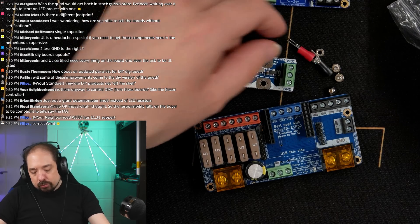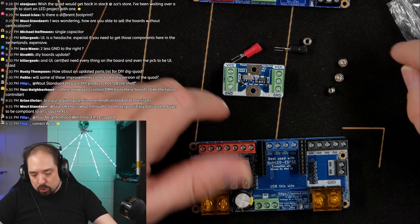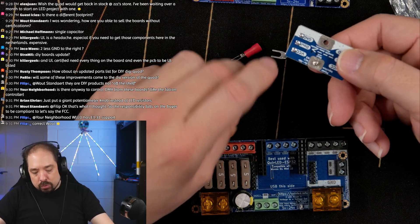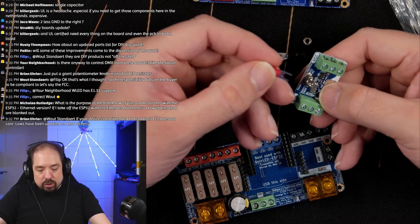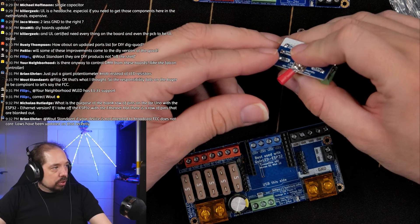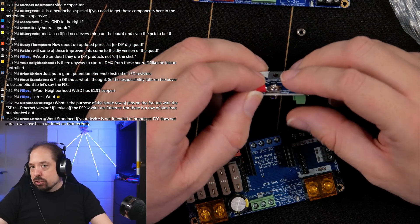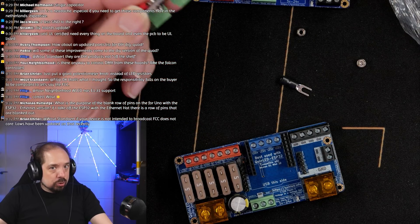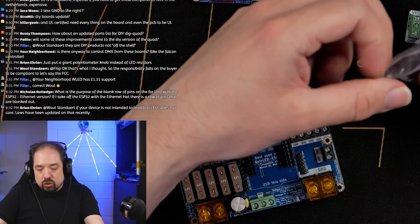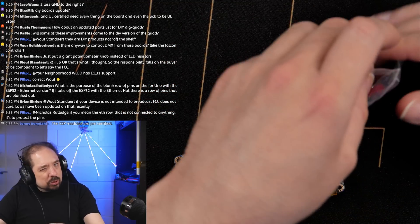The Data Booster comes with some accessories: two fork-style crimp connectors for use with the M3 size holes, plus an M3 screw. The screw goes on the bottom, and you can add power on the back side using the fork terminal. You can even bend it a little so it's parallel with the lines coming in and out. That's an additional feature for power injection without having to solder. It's a multiple-function board for power injection or changing the resistor size. Articles about all of this are on the website and linked in the description.